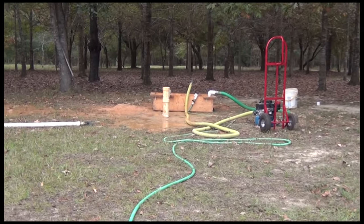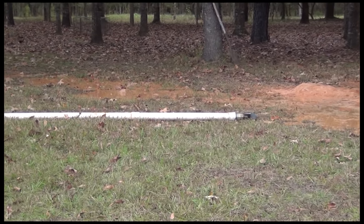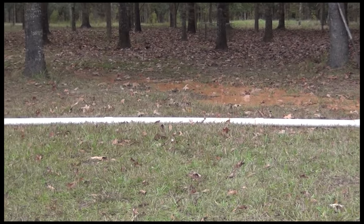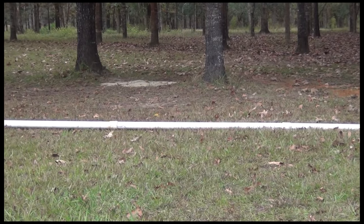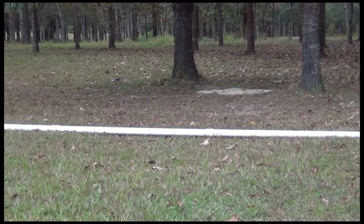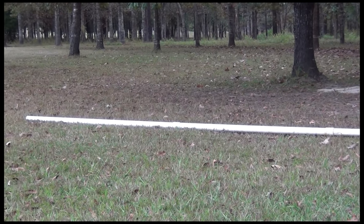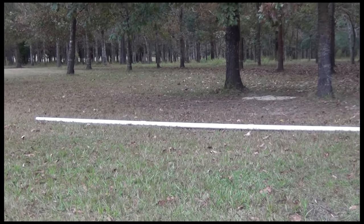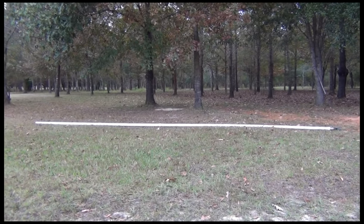When you quit for the day it's a good idea to pull your drill pipe out. Here I've drilled to twenty-four feet and I'm stopping for the day. With use of a recirculating drilling fluid system that includes a mud pump, bentonite, a metal drill bit, and a mud pit, 2-inch diameter well depths of fifty to sixty feet are routinely achievable. For more information on how you can drill your own well, go to www.drillyourownwell.com. Thanks for watching.